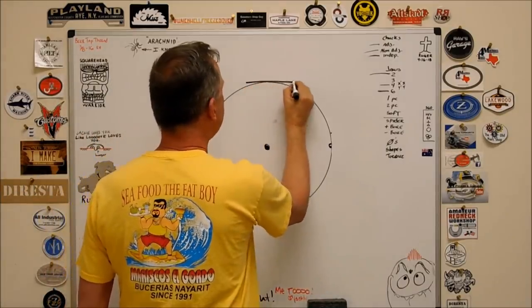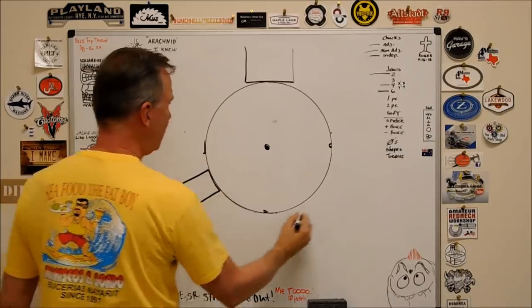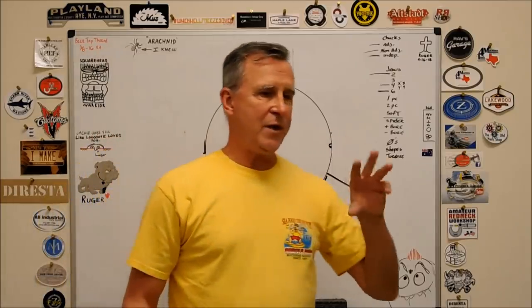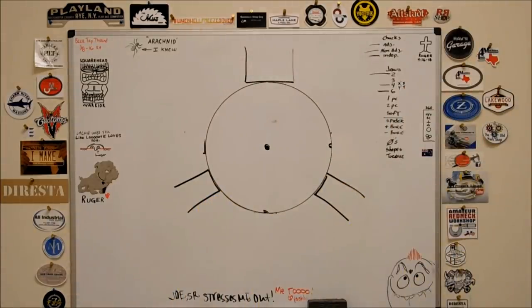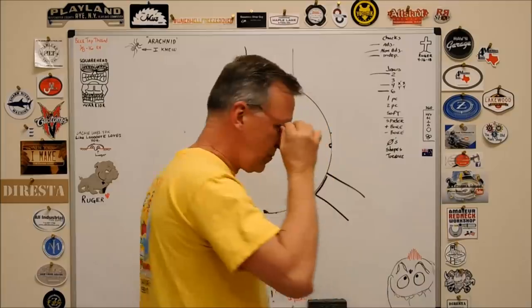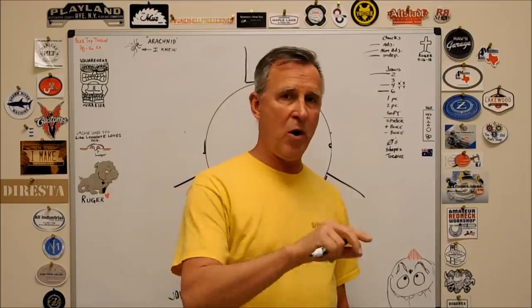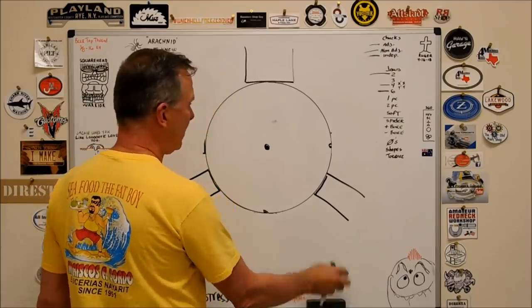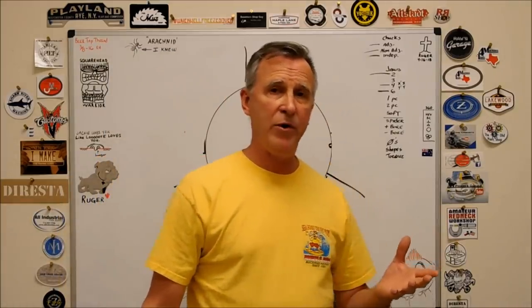Three jaw chuck. Every 120 degrees, there's your contact point. That's pretty good. When you squeeze something in a three jaw chuck, now bear with me for just 1 second. I'll make sure we're still getting this because this is golden. If you have an out of round condition or a low spot on the part that you are putting into a three jaw chuck and you don't realize it, the rotation of the part could find that low spot and that part could come out of the chuck.